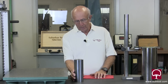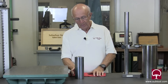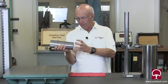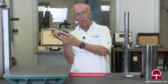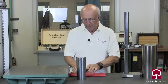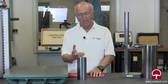This particular cylinder square right here, I made this when I was a toolmaker many, many years ago. I don't even want to talk about how many years ago, but this was an interesting project because I started out with a piece of tubing — I didn't want it to be too heavy. I carried it around in my toolbox, bored a hole in the back edge and the front edge, made a plate for it, put a plug in it, turned it on a lathe, turned it all over, sent it out and got it heat treated, brought it back and rough ground it, then sent it out and had it dipped in liquid nitrogen, which stabilizes it again.